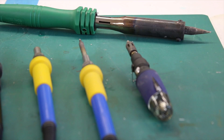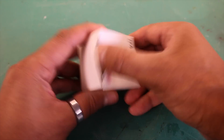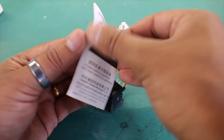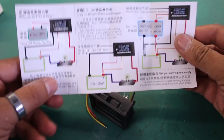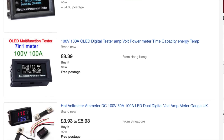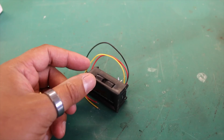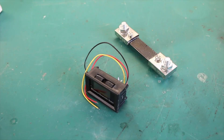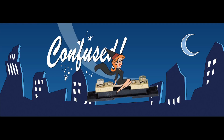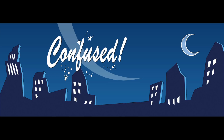Next, on to the wiring of the gauge. As an amateur electronics hobbyist I thought these things are pretty much plug and play. My first gauge I bought was a 10 amp gauge and for a 70 amp system, clearly that was a quick lesson. Back to eBay and this time I bought a more suitable 100 amp gauge which came with a shunt. Now I've heard of shunts before, watched the videos and even read the websites, but for the life of me it's all witchcraft. So I did what I do best — took the plunge and just wired it all up, and finally now I understand how shunts work.